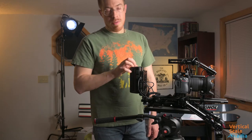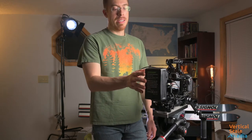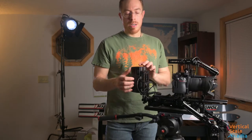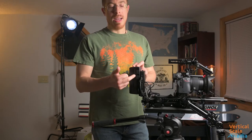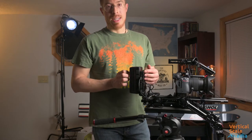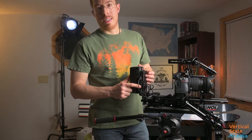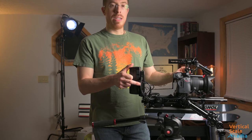So, it wasn't a flaw with the battery. I have 2 of these batteries. They both perform the same way. They're different brands. One is Tether Tools Onsite. This is newer. So, battery stuff aside, you won't be able to run a USB off of the V-mount plate, and you won't be able to run it off of this at the same time. You'll have to either run a USB hub and do one off of the plate, because the plate does not have the limitation of having to require a certain amount of current to keep it active, or you can do like I did and make a D-tap plug for your Nucleus motor. Just don't get them confused, because that's a raw 14 volts into the Nucleus motor.